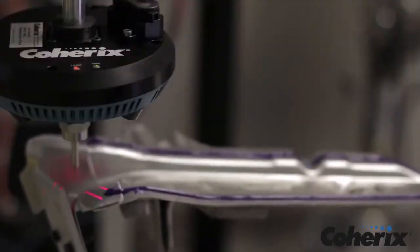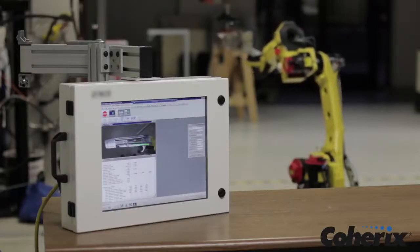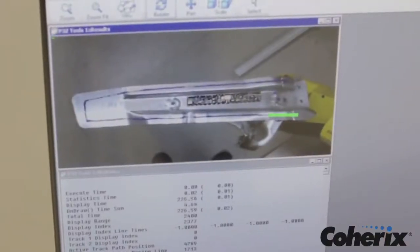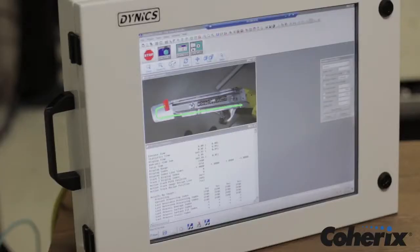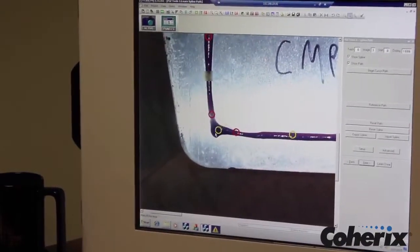While the sensor head is inspecting, the actual bead path is displayed on the operator screen and continuous information is provided to show the width, height, volume, and position of the bead relative to the part. If a skip or neckdown criteria is exceeded, it is shown in red to indicate a defect, which enables the user to take action according to their process control procedure.